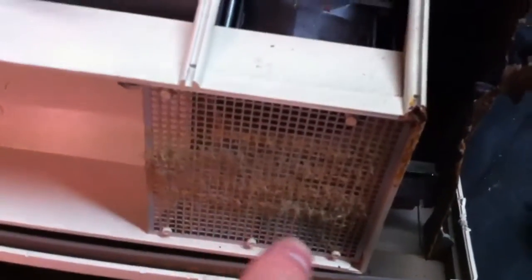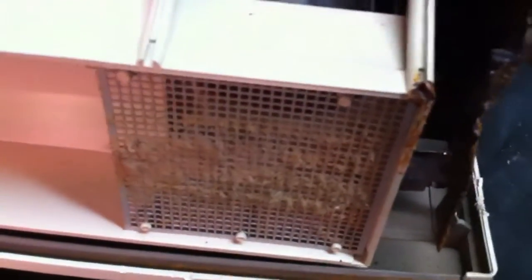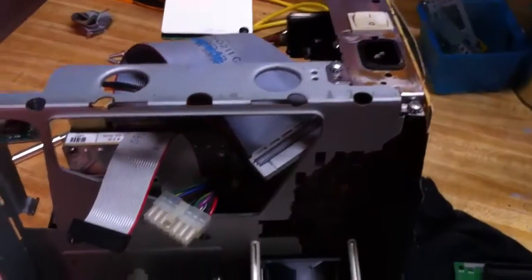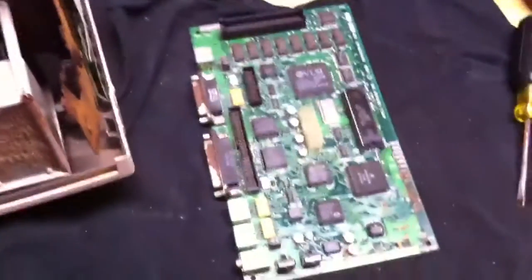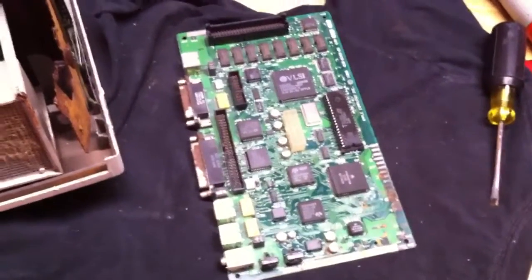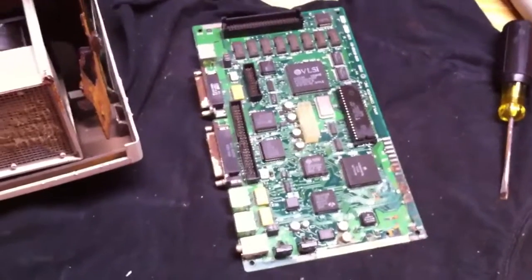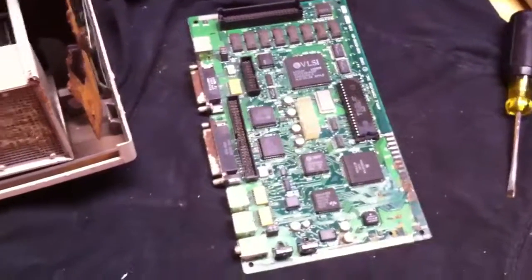While you're in the machine, you may notice dirt on the air filter — get a vacuum cleaner and vacuum that out so there's plenty of airflow inside. Make sure the fan is running when you turn the unit on. The hard drive may sound like an old refrigerator due to its age, but as long as it works you're fine. Do all of this with the power disconnected and give the motherboard plenty of time to dry. Leave a comment letting me know how it worked out, and check out my other videos — thanks for watching!